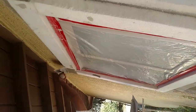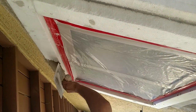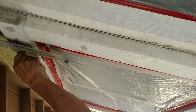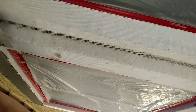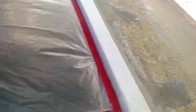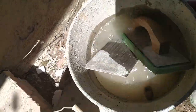For the last step in prepping the foam, we're going to mix up some more foam prep. Now that we have everything mesh taped, we're going to apply a layer of poly bond — foam prep — over it. Foam prep is basically just cement with glue mixed into it, a very fine aggregate. Once we mix it, you want to get a bucket, fill it with some water, and have a green float, basically like a sponge. You can get them at Home Depot.